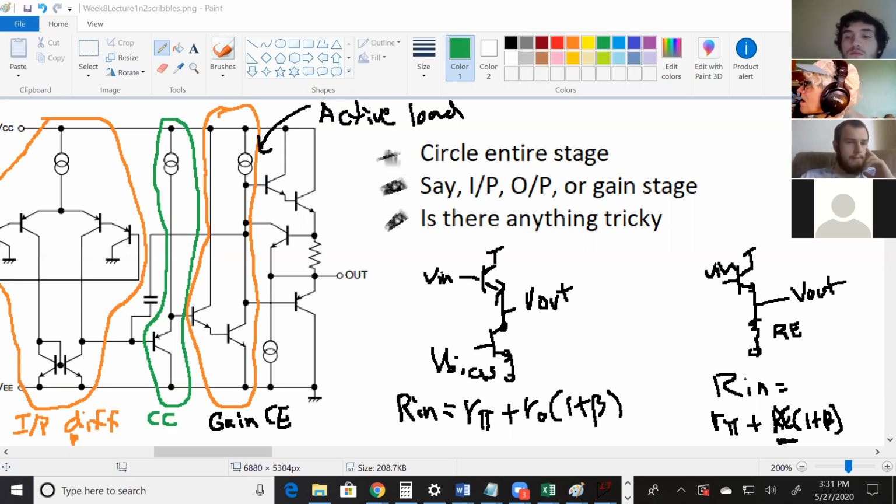I'm not sure what the official definition is, considering every textbook I look at gives a different definition. Just as long as you can recognize it and know how to make it run correctly, I think, but in the purest form, it's just those two transistors. Okay. And the diode connections are considered biasing. So I guess that's the answer, that it's a push-pull. Yeah. Now, the tricky part is which transistors make up the push-pull. Yeah, that's where I get really confused. That's why I was asking that question.